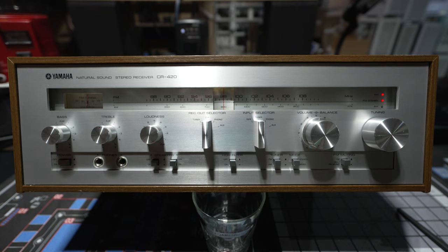This unit was rated at 22 watts per channel into 8 ohms, which seems really low. But Yamaha was very conservative with their amplifier power ratings. Audio Magazine, which was a big deal in the 1970s, tested this unit in 1978 and found it probably should have been rated at 31 watts per channel into 8 ohms. So it actually puts out a decent amount of power, and unless your speakers are really hard to drive and inefficient, you can get a lot of volume out of this relatively modest unit.